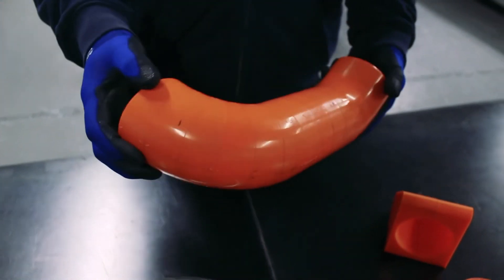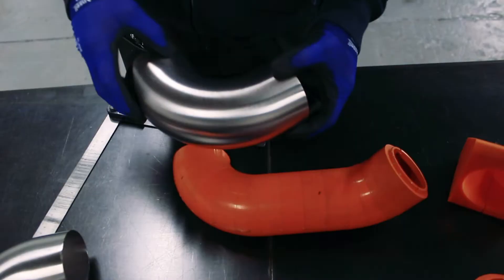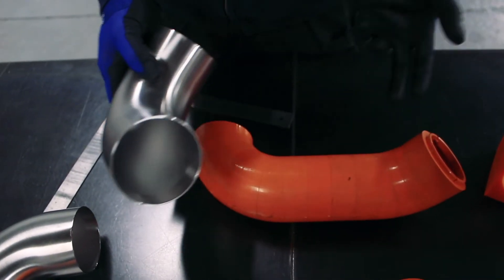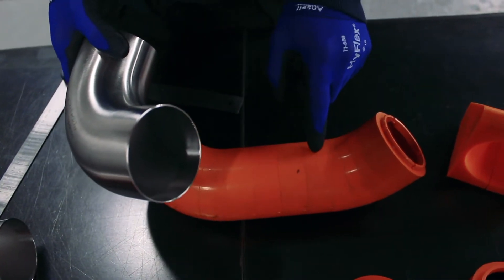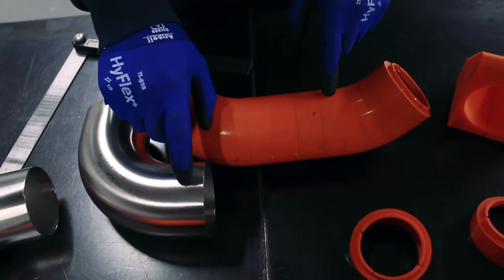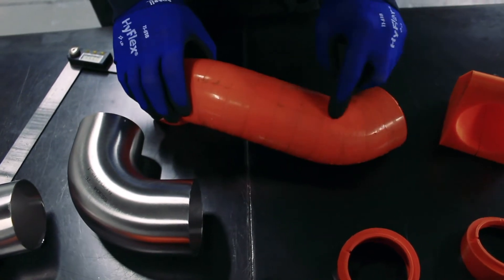The first thing to bear in mind is that these tight-radius bends we sell have a 34mm leg, and all the straight blocks in the downpipe kit — bar the 1.5-inch one — are one inch long, so 25mm. That's a little unfortunate because they're about 9mm short of the legs on here, but it's just something you've got to work around. I need a 45-degree bend and a 90-degree bend. The 90 is easy — I just need to cut one leg off. I've got four 25mm straights, so I need to take that 34mm out of the 100mm of straight — that's no problem.